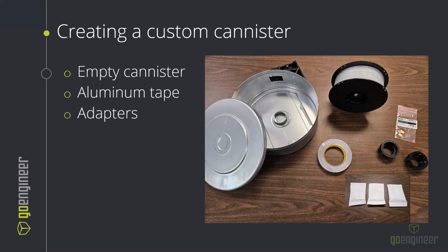So you could use an existing spool off of a 450 that's already loaded in a purchased canister, but Stratasys has actually started to warn against that because you can get cross winding and jam the canister. So printing adapters seems to be the more preferred approach right now. Get an EEPROM chip. That's the small baggie on the right side of the screenshot here.